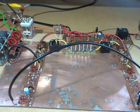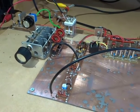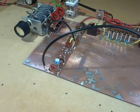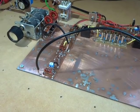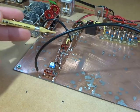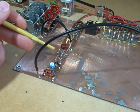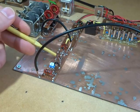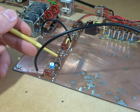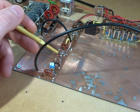At this stage, I haven't done any kind of characteristic testing in terms of minimum discernible signal that it can pick up, or anything like that. But suffice to say, from the little bench testing so far, those Homebrew DBMs, those Homebrew double balance modulators, or mixers I should say, getting a bit tongue tied there, seem to perform really well. So it certainly pays to take the time to match those diodes. That certainly makes for a nice balanced mixer. So that seems to be working well.